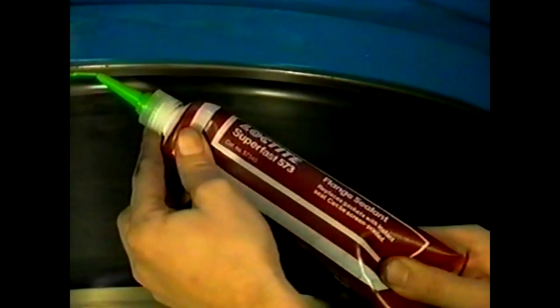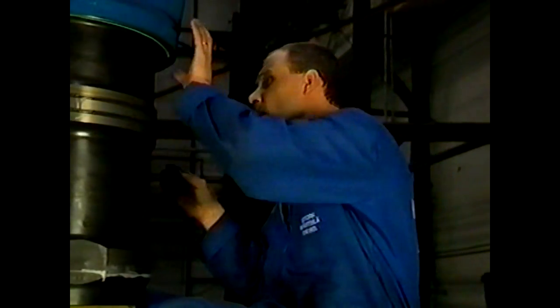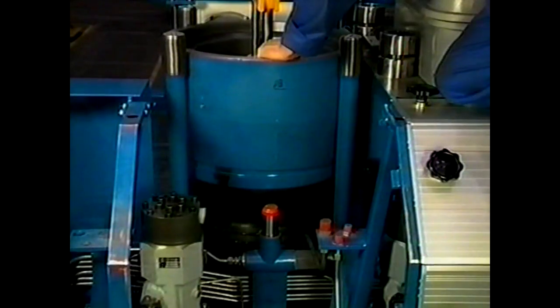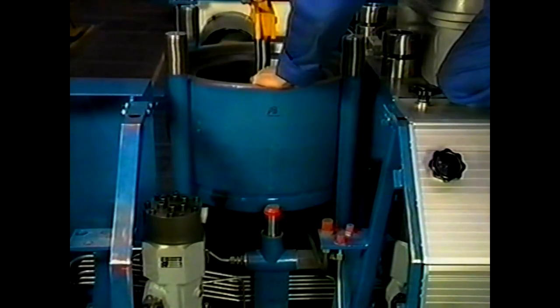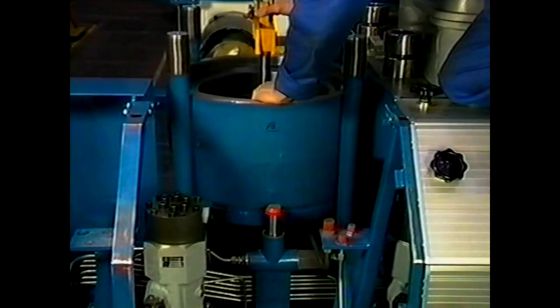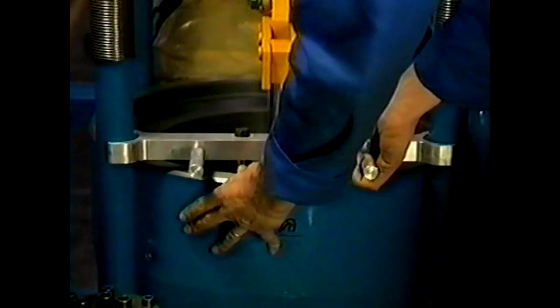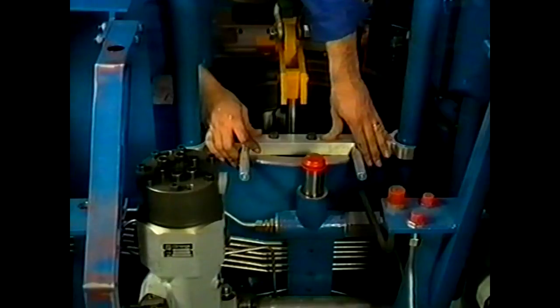It is recommended to cover the complete bearing block. Now the liner can be installed. Lubricate the liner edge with the prescribed Loctite for joint face sealing. Since the liner edge is lubricated, any dirt trapped on the sealing edge of the cylinder block can easily be removed as this edge is a dry surface. Lower the cylinder liner slowly into the engine block. Fit the positioning tools before the liner falls into its bottom-most guide rim. Place the positioning tools between the two front-most cylinder head studs — the two positioning pins then fall into two cooling water channels of the cylinder liner. Make sure that the mark M above the front-most sensor hole is 39 degrees out of centre and points in the direction of the fuel pump. Guide the tools by hand when lowering the cylinder liner.